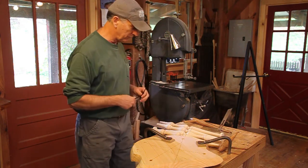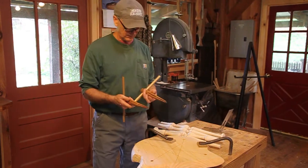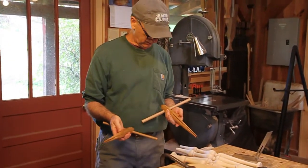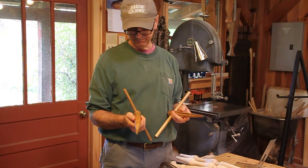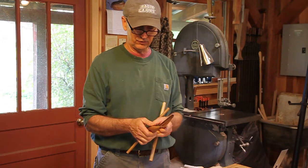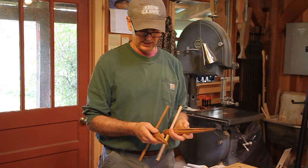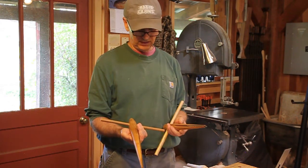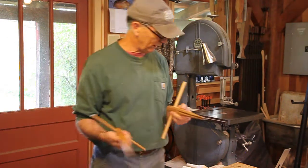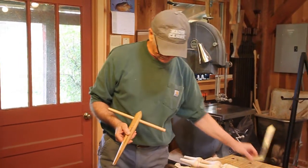So now the reamers that I use are 6-degree reamers. They're made out of a saw blade, or can be made out of a saw blade. If you want to make your own, you can go to, I think, Green Woodworking site. I believe that's what Alexander has it called, and you can make one according to that. Or you could buy one. Alia Bazzari makes these, and Tim Manny makes these, and you can find them both on the web and buy them. So these are 6-degree reamers.